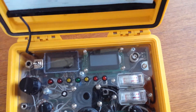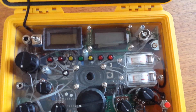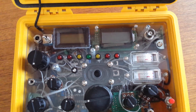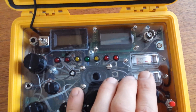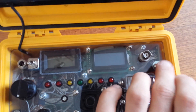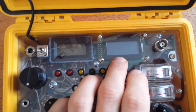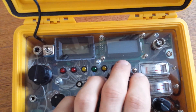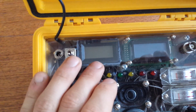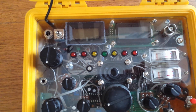These are forward and reflected power meters — SWR — so you know if your antenna is resonant or not, and how much output power you have, so you know if everything is working properly. The SWR bridge is mounted right here underneath the panel, with a BNC connector as the standard antenna connection. Here's the illuminated LCD screen that displays the operating frequency. This is a digital voltmeter, also an illuminated LCD. And these LED lights along here are part of a zero beat indicator.